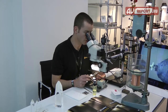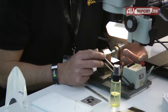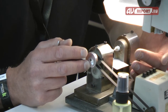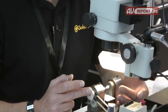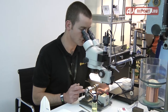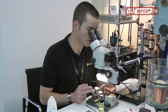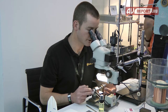We're using copper wire. It's 0.03 mm in diameter. It's insulated wire, and what we're doing now is bringing the wire onto the coil, onto the armature, and I'm now going to start winding. In this particular cartridge we're winding roughly 60 turns of wire per channel. I'll start off by winding one leg.